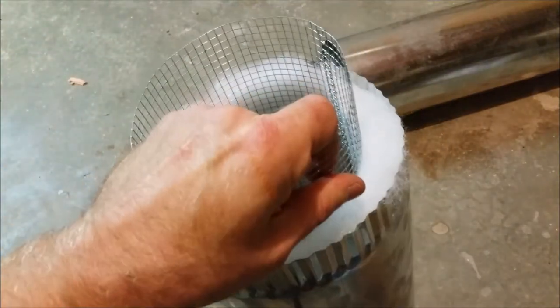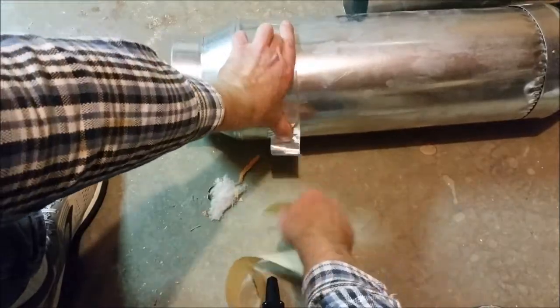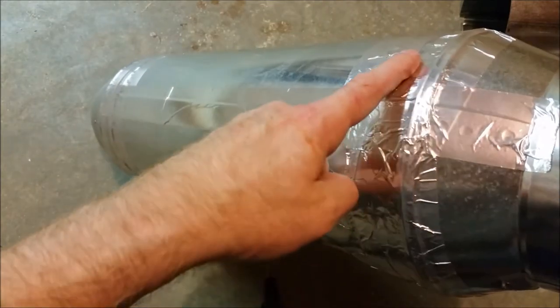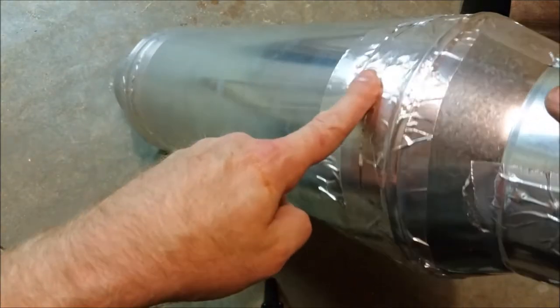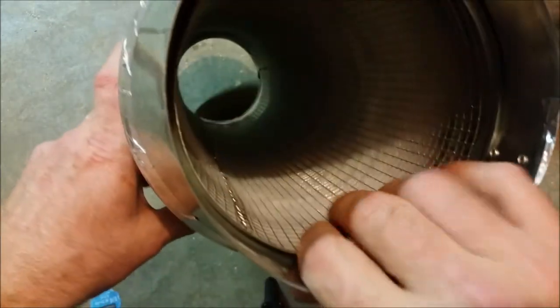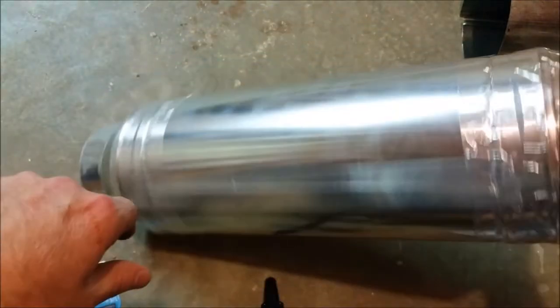You can put some polyfill around there as well. Once the reducers are on, tape the duct muffler up and install it. After you assemble it, tape all the seams so there are no air leaks. The finished sealing job is shown here. Also, when filling the duct with polyfill, make sure the duct stays round — otherwise it seriously restricts airflow.